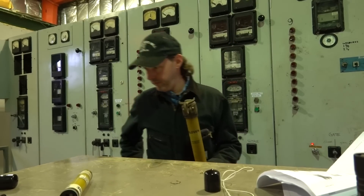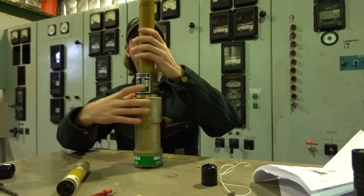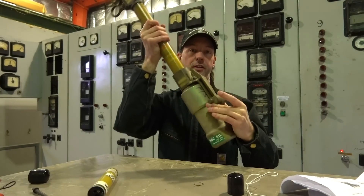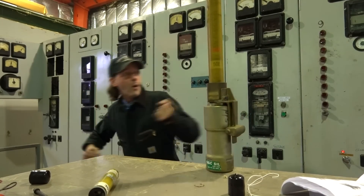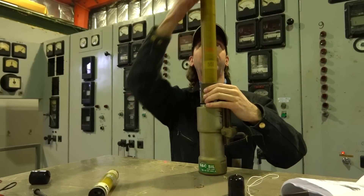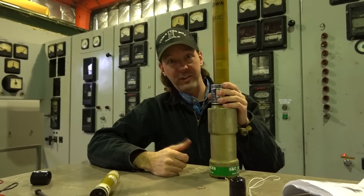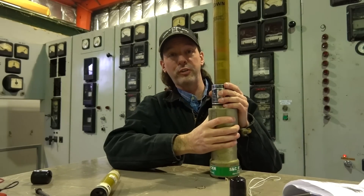So that's in. I'm going to grab a wrench in a minute and tighten this all up. But this is the thing I wanted to show you guys — this is a real fuse. This assembly here is the actual fuse; it goes in and drops in the fuse holder here. Then you grab this with a hot stick on the end of a very long fiberglass pole, you just WHAM! and slam that in. This actually electrically connects up here and down here — that's your electrical connection. When the fuse blows — now this one's been in the same spot since the 60s — so this isn't a thing that happens terribly often, which is good because you don't want to blow large and very expensive fuses like this on a regular basis.